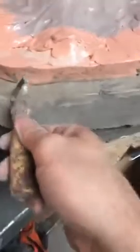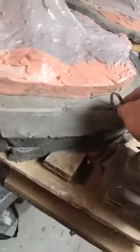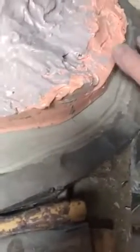Really, no. I do have a natural registration that will occur because I'm going to drill holes in my fiberglass for the two sides, and because I have those, I can make sure they line up. They just won't lock as well. So in other words, there's a little more air that will naturally be able to come out. By having a good registration mark, I'm reducing the amount of air that can get in, and therefore I'm going to get a little better seal, which means my foam's going to go better, latex isn't going to leak out when you fill it, any of those kinds of things.